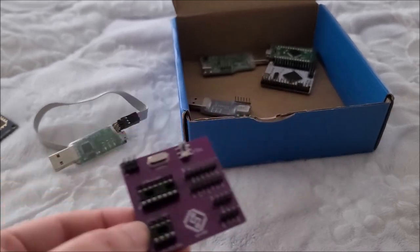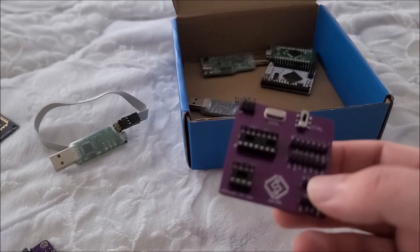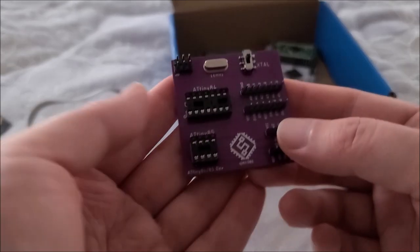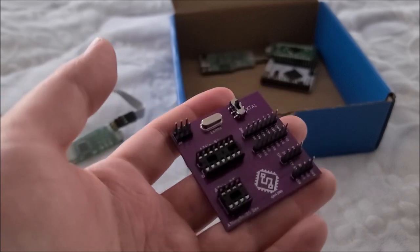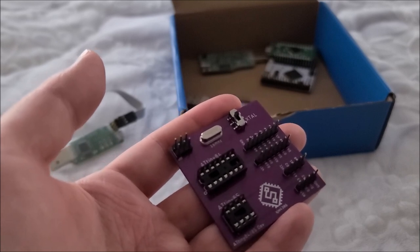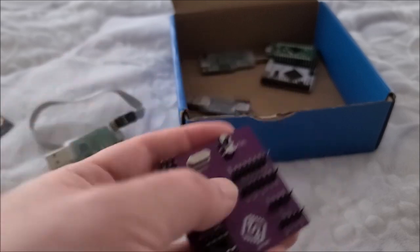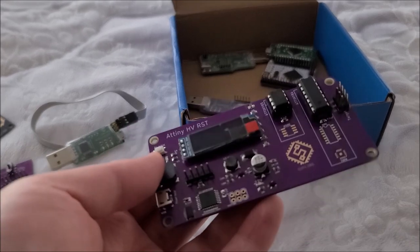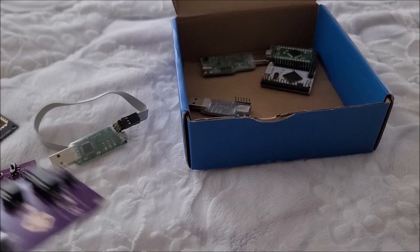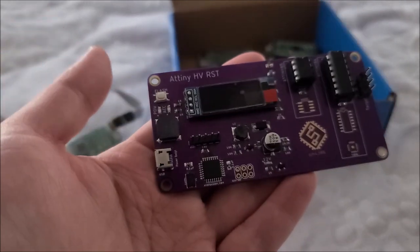It is still possible using this method to brick ATtiny chips. Additionally, because they have so few pins, I'd like to reuse the reset pin as a GPIO. But that means between development cycles, for firmware revisions, I'd need to high-voltage reset the chip — once you use the reset pin as a GPIO you probably can't program it normally. I also wanted a way to mess with fuse settings without permanently bricking chips, especially with the component shortage.